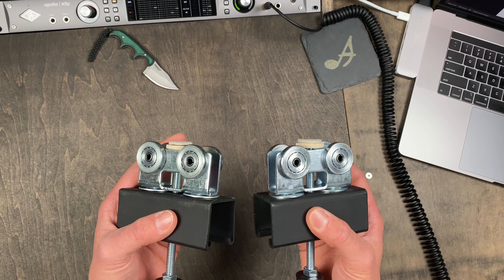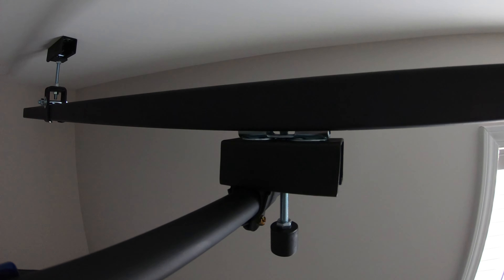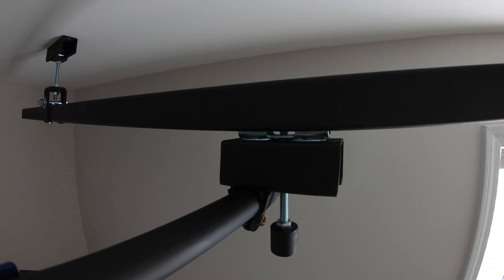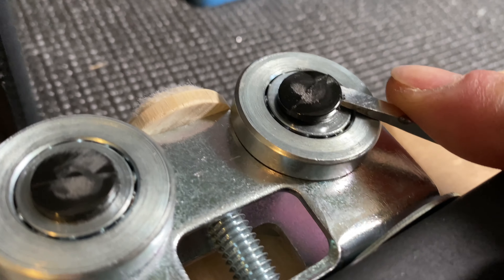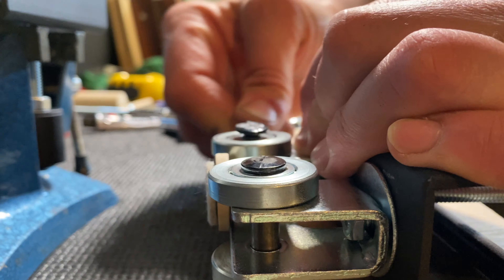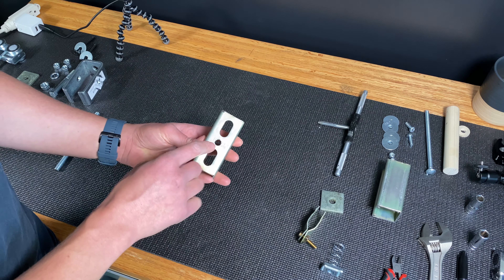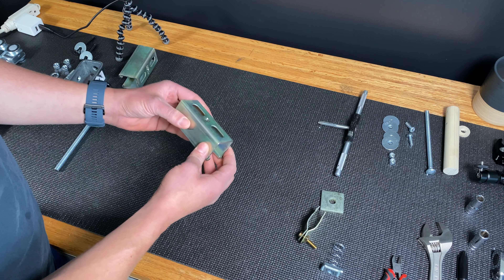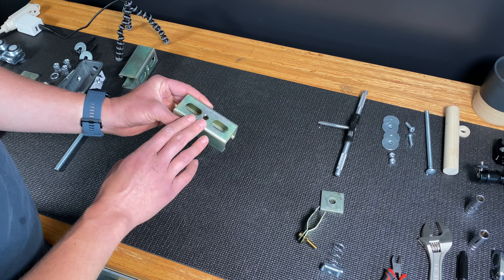This modification — adding plastic fasteners — is actually unnecessary. It created too tight a tolerance and kept binding as I slid these trolleys back and forth, so probably my favorite design innovation in this entire project has to go. The last mod is drilling a hole through the small section of channel in order to allow the adjustment screw to pass through into the trolley — I'll explain this in further detail in a minute.